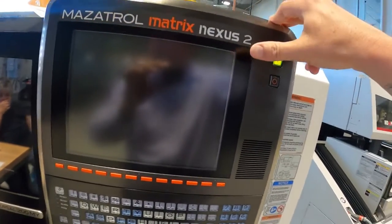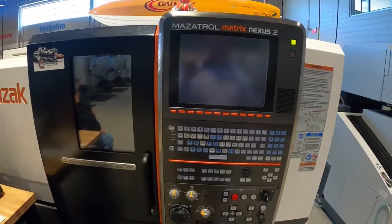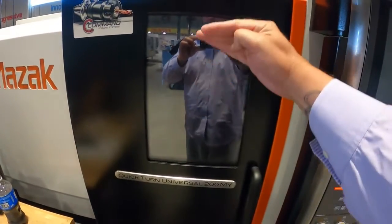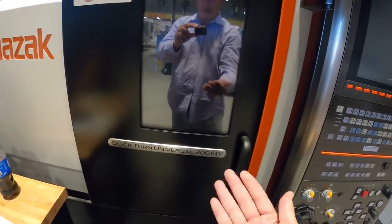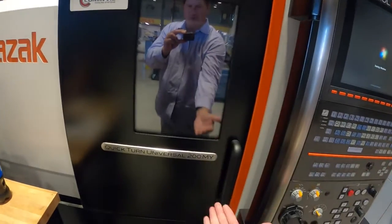Let's talk about homing out a machine. X is near and far, Z is left and right, and Y is up and down — the whole turret comes up and down off center.